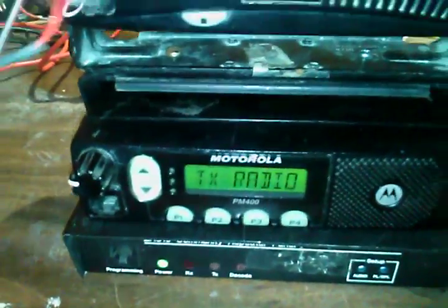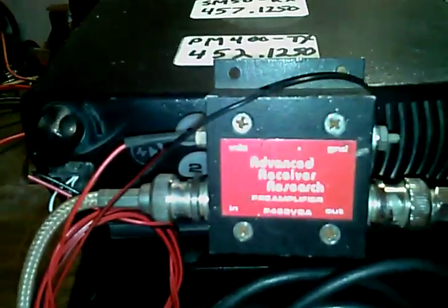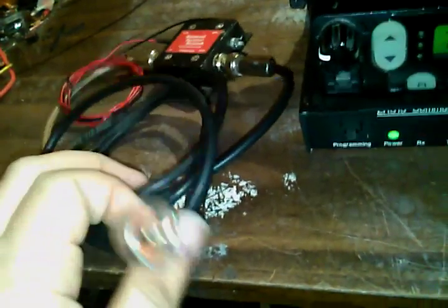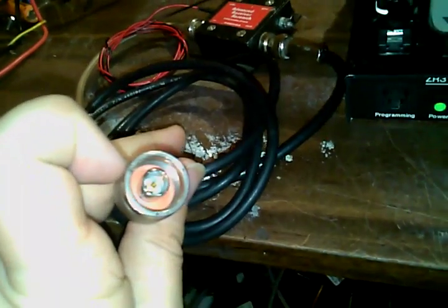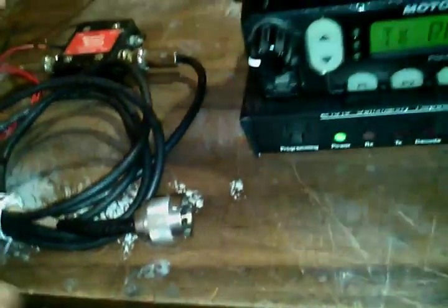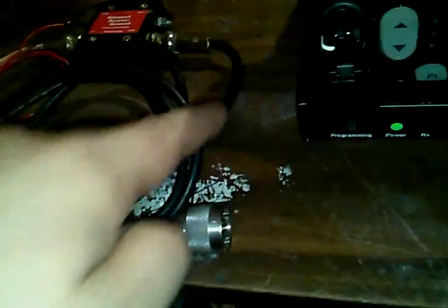There's this little gem I'm going to install — it's a UHF receiver preamplifier, already been tuned, with new power leads and the in/out cables on it. From the input coming from the antenna, I'm going to put a bullet connector in here, hook the receive antenna, and then it's going to go out this black line and into the SM50. That'll increase the sensitivity on this radio so we'll get a little further range.